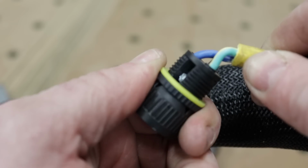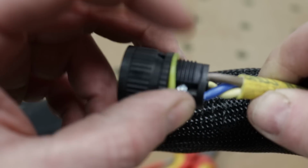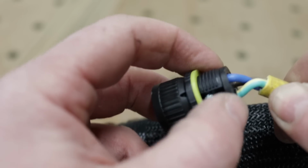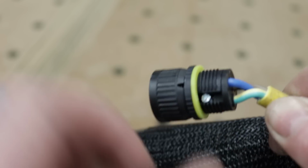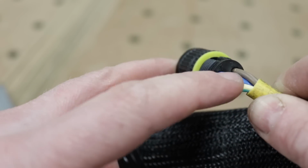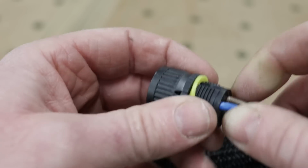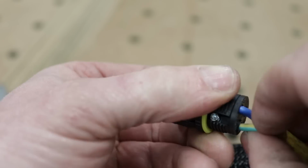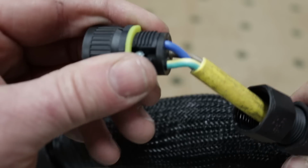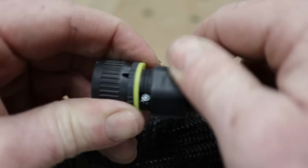Okay guys, so there's what it should look like when we are finished. Our entire copper is hidden. There's no copper popping out here. We have no spare strands. There's nothing sticking out. Like I said, it doesn't look like a magpie's nest. Everything is caught nicely inside in the screw, and the insulation is all the way to the back of the socket here. No copper on show, and you can give them connections a good little pull just to make sure everything is cinched down and in place. And once that's done, then you just slide this guy up and twist him on.